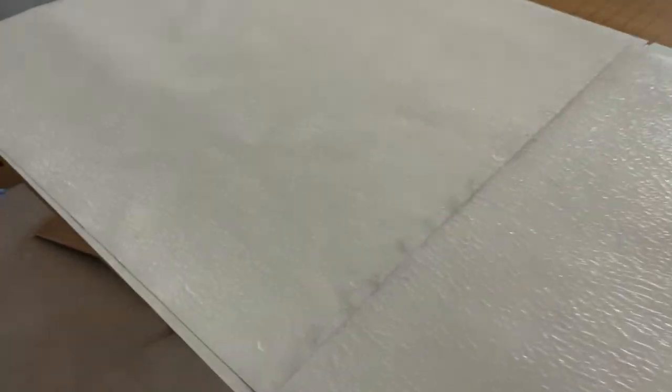So how much paste do you want off the back of one of these sheets? That's about it. That's not very thick. Okay? You want enough to make it stick. If you're putting it on where your finger would make like a snowplow if you ran it down against this paste, you put too much. Thin layer.